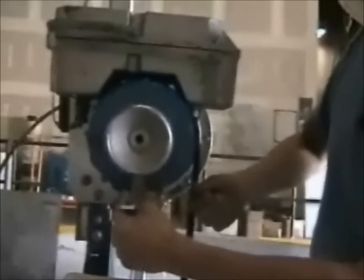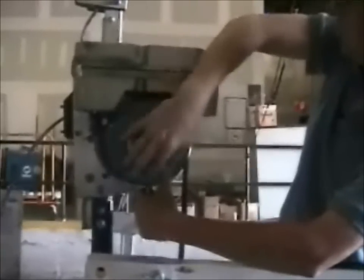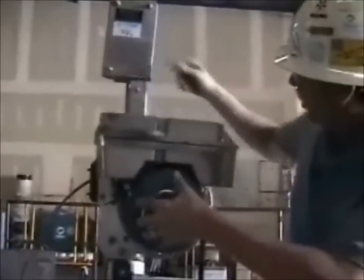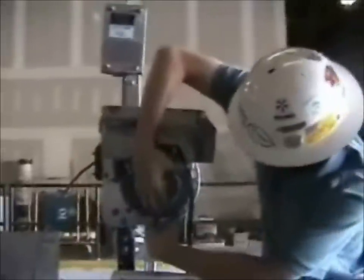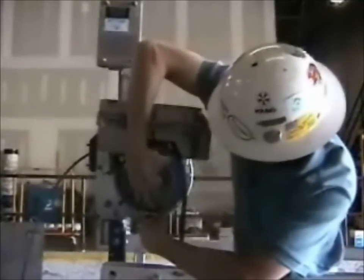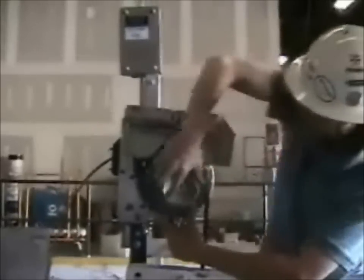What I have to do is pull out on the controlled descent — that will release the primary brake and allow me to turn the handle in the clockwise position. If you watch the wire rope right here, you can see it's actually turning the hoist in the up direction. I'm going to start cranking. Now I'm starting to get under a load. So what I'd normally do is pull out on the brake, turn the hand wheel clockwise, let off on the brake, pull out again, turn it clockwise, let off again. You'll notice I'm actually raising the hoist by about a quarter inch of turn.